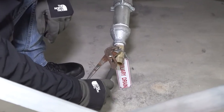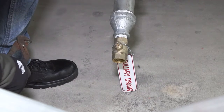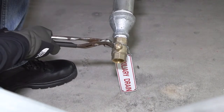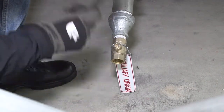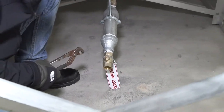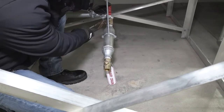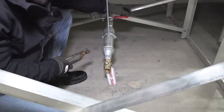We have air. You want to do this about five times — you're going from open to closed, draining it, shutting it, opening it, shutting it. Make sure the bottom valve is closed when you reopen the top one, allowing air back in. Close, open — you can hear just a little.